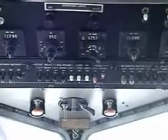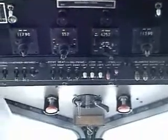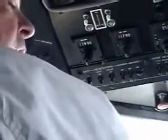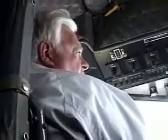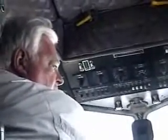On that one, of course, the pilot can see it. The pilot has to watch for his own fuel to drip out the drain and count the number of blades, and the co-pilot will turn the left-hand ignition switch on for the pilot because he's actually twisted around to the left looking out the window at his left-hand engine.